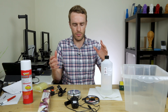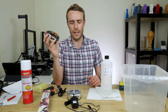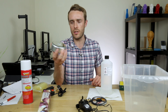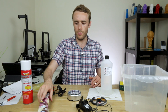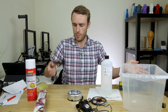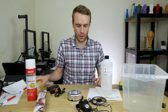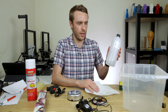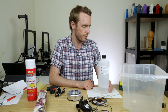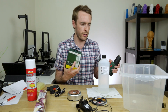Today we're going to be creating a box for curing resin prints. For that we're going to need some UV LEDs to cure the resin, a power supply for those LEDs, a small turntable, some reflective foil — I've got aluminium kitchen foil — spray adhesive, a box, probably some hot glue because what project doesn't use hot glue, isopropyl alcohol to clean out the box, and lastly potentially a drill and some drill bits to put the connector in.